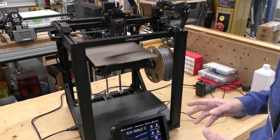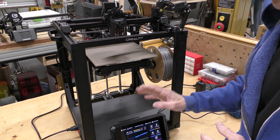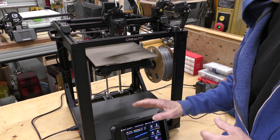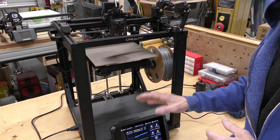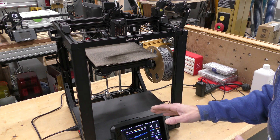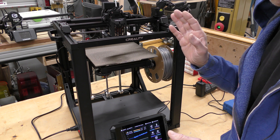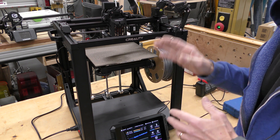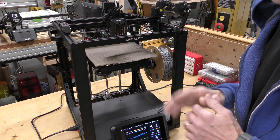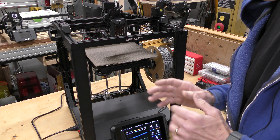So here's the machine with all the upgrades. I really am happy I have the Sonic Pad with Klipper on this machine. Just using the stock PrusaSlicer settings and changing the acceleration to 5000 really made a huge difference — this machine is a lot faster now and prints really, really well. I just have to tune it a little to get rid of the stringing. The machine's a lot quieter now that I changed out the fans, and that breakout board from Nathan at Nathan Builds Robots was huge. Now that I have the camera, I think I can leave this machine out in the garage with a cover over it and print out here so it's not making noise in my office.